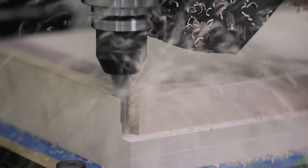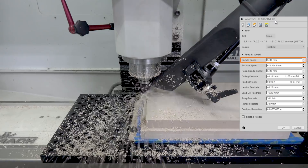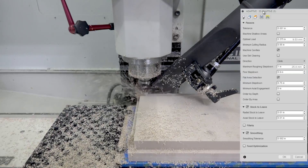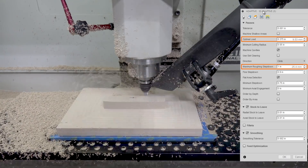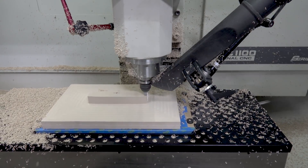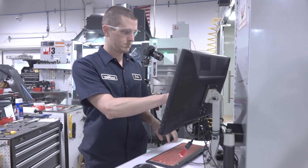And we're off. The first thing we're doing is a 3D adaptive with that Taz tool — all the RPMs we've got, 0.007 inch feed per tooth, or about 46 inches per minute, taking a 75% stepover and a 1-inch depth of cut. What I like about this recipe is it's making a bigger chip, and that's going to really help cut down on the dust. Let's take a look at some slow motion footage to get a better idea of what that cut actually looks like.